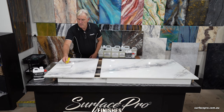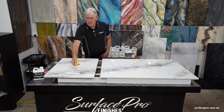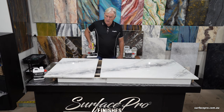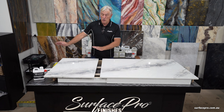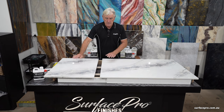Drawing it towards you, overlapping it 20 to 30 mils, number two, number three, number four, and number five. Just goes to show you with this one here, you can get five passes and it's done. And that's all it is with the dry roller. That's done and finished, you can leave that.